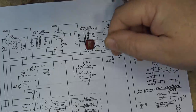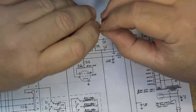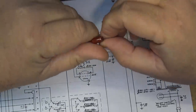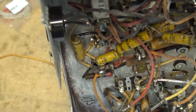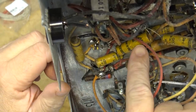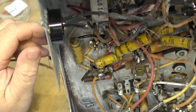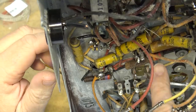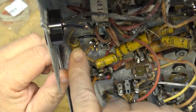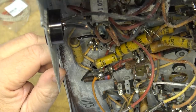But a lot of times it's overblown, and that's why they don't even bother to mark the capacitors anymore, because it's not as big a deal as it was back in the early days of these ones, which, just because of their physical size, have a lot of surface area exposed that's going to pick up induction from outside of the radio, from other stages and from RF and from just electrical interference. There's a much bigger chance that something like this is going to pick up induction than, say, something that is this size.